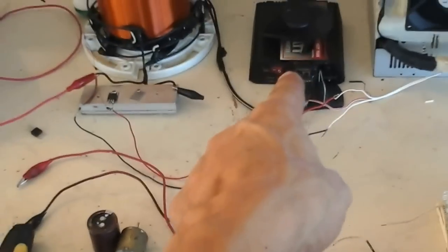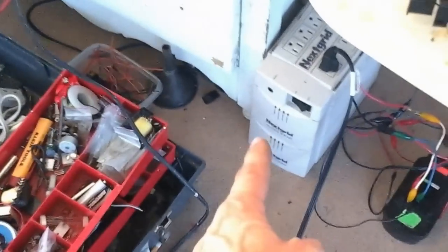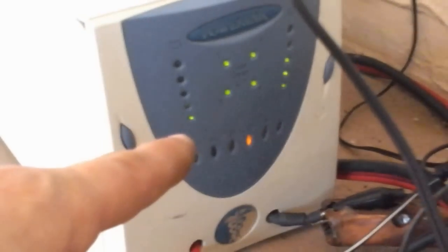So that's that inverter — this is all running off of two computer power supplies. I've got 12 volt right there and 12 volt down there, and I will eventually have another 12 volt right here. That is my 24 volt rail. The only reason I made this whole setup is so I can get this going. Right now my load isn't even full — I still got two more bars I can pull up on my load. This ATX power supply will stay right there.